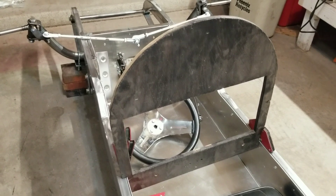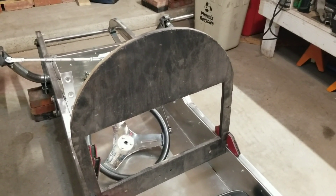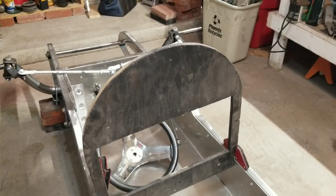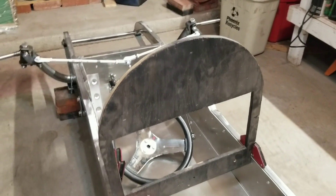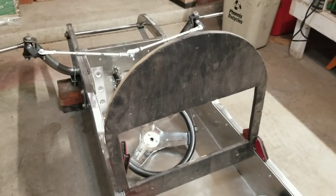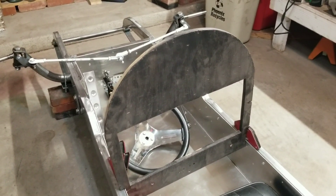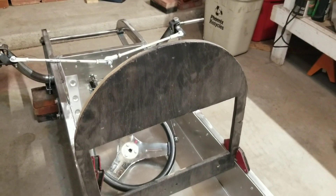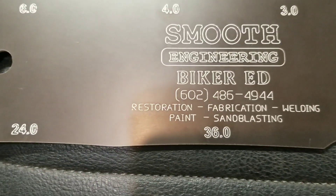Now we'll turn our attention to the front piece. This is the original grille piece for the mock-up on the Model T that I built back in 2015 — I hung onto it thinking maybe I'd have a use for it, and here we go. It is the perfect size for the cowl shape on the front of this car where the dash is going to be. So I'll bend a piece to fit that at the right height — it might be a little bit taller than this. I think the hood is going to be a little taller than my cart. I'm using my contour gauge that my buddy Ed — Miker Ed from Smooth Engineering — made up. This is really handy, mostly for sheet metal work.